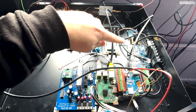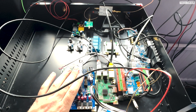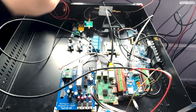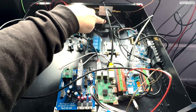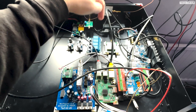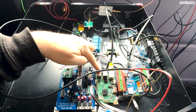You've got the Pluto for transmit. That goes out and connects to the amplifier — you've all seen that in the other video. The receive is here. Now, because this is all going to be mounted somewhere else, it's all going to be working over Ethernet. I've got an Ethernet socket on the back going into this hub — an Ethernet switch, very cheap, about £8 off Amazon, made by TP-Link. This is going to be feeding three devices: the Pluto on network, an Arduino on network, and a Raspberry Pi on network.